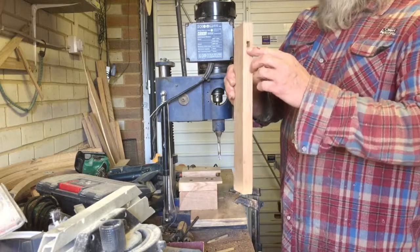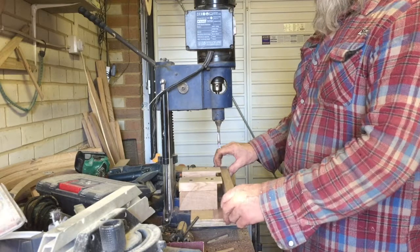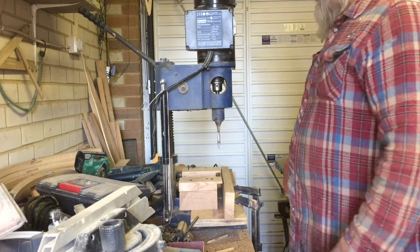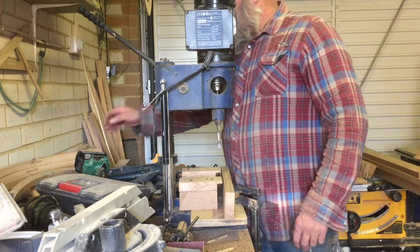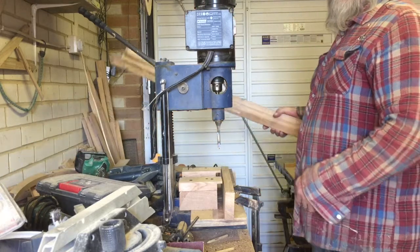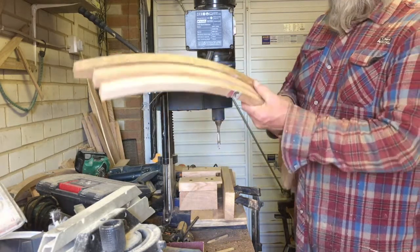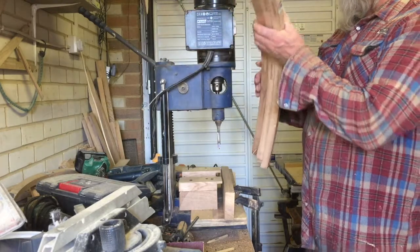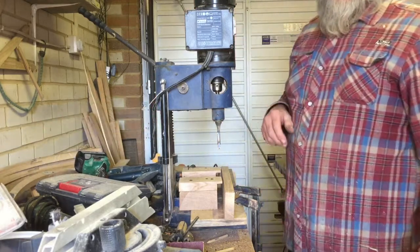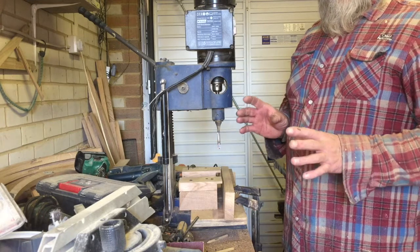Keep chopping down like so — I'm not going to bore you with loads of that, but as you can see that's the sort of thing you do. You turn it over and chop through. I've only got this one to do then I can get onto the tenons, so hopefully by about lunchtime I'll have those top sashes all glued up. Going back to the arch top windows, the main frame is already glued up and these other parts of the frame have all been through the router now. The reason I'm really having to push on is I need to get the sash sizes done so I can work out the glass sizes.